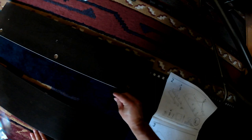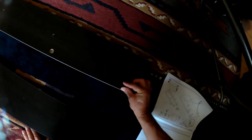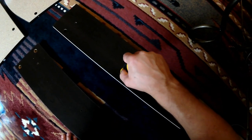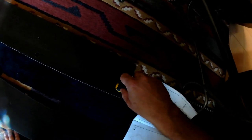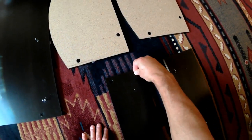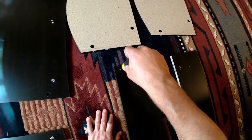What's going to happen is we're going to put the C and B boards together with the three cam bolts from C going into the three cam locks of B. I missed the clip somehow when I was editing — probably got distracted by creatures crawling around — of putting these two together. But the three cam bolts on C will slide into the three cam locks of the B board. Once attached, these two together will go on to the big G board — it's the corner leg piece. They make an L shape and create a considerable amount of support.